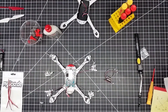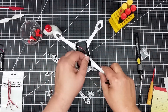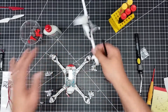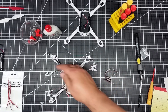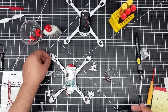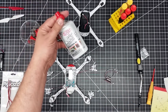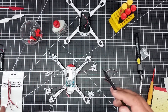I have this opened up and I've removed the top. The top comes off with a couple DuPont clips that plug in here - I'm assuming these are for the compass and the GPS antenna, which are in the top. There are also screws in these end pods once you remove the feet that you also have to take out. I've removed the gears and kept them in order. I've already cleaned them, because one of the things I'm going to do is lube them with some Teflon dry film lubricant before reassembly.